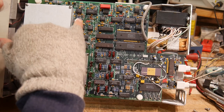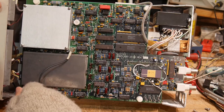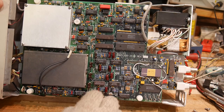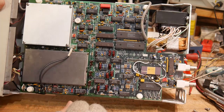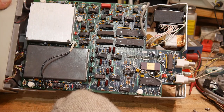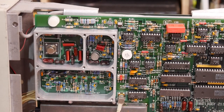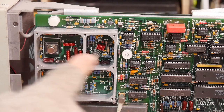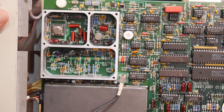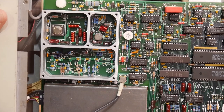There's a voltage reference here — an LM399 in a little oven — and a lot of mica capacitors. You can see some bodge wires on this one, confirming it was definitely a prototype. Inside we have the 50 MHz reference oscillator in three parts: first, a 50 MHz Colpitts oscillator; then a pin diode switched stepped attenuator — I forget how many dBs of switching, but the oscillator itself has a 10 dB range, so you can calibrate at 0 dBm, minus 10, minus 20, minus 30 dBm, switching the pin diode attenuator for each decade.